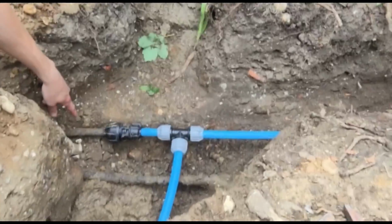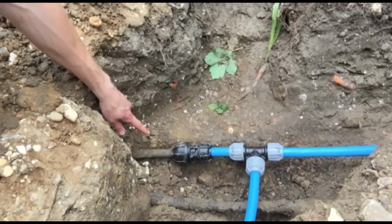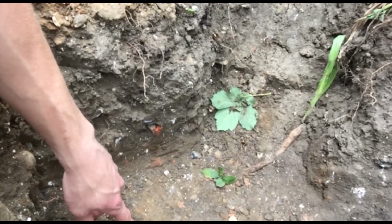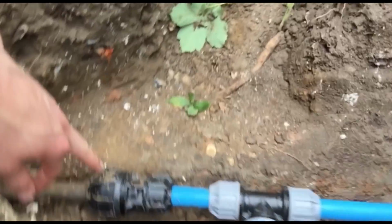So here's the original lead pipe that goes into our property, and basically what I've done is added a Philmac UTC, which is a universal transition coupling device, which connects to lead pipe, copper pipe, any kind of pipe at all. It's got some grips on the inside of it and quite a thick O-ring, and they have different size ranges for those coupling units.